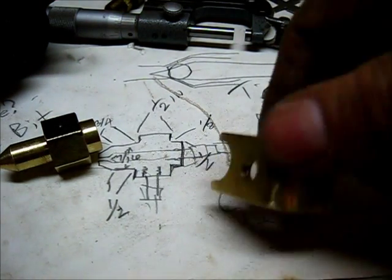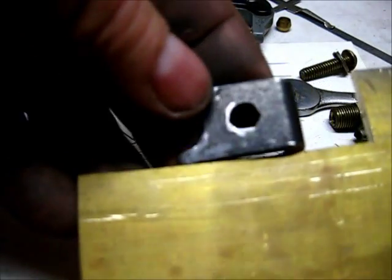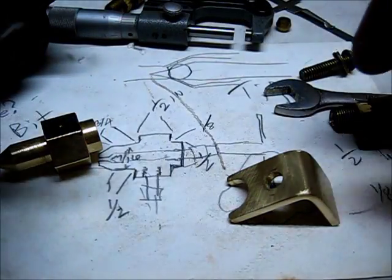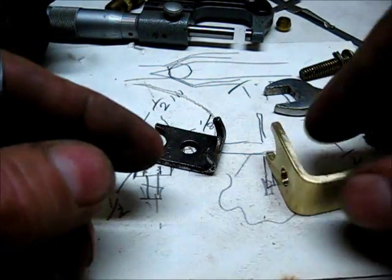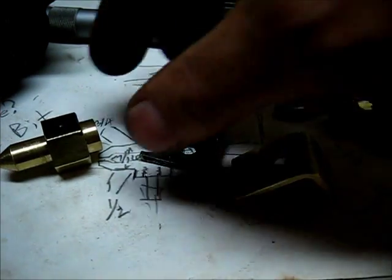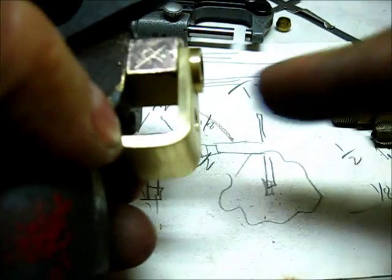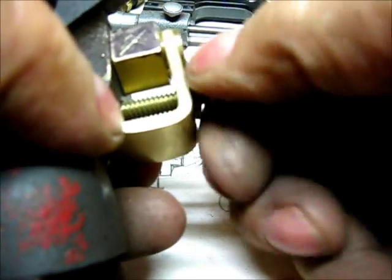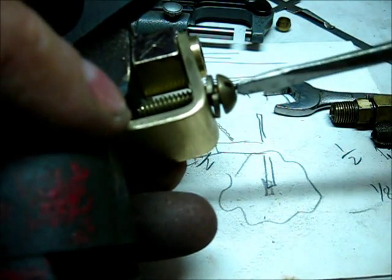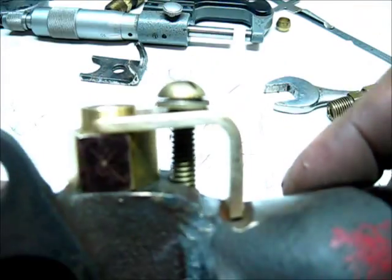I have just made this little thing right here - cut it out of a piece of brass, just kind of sawed off a little sliver, a long piece, laid it out, put the two back to back, marked it out, confirming everything with the square so it would all be plumb, straight, even, and workable. This will go in here like this. The leg is the correct length, and I did secure a brass quarter-twenty thread screw and lock washer. As you can see, that's where it will live at, just right there, just like that.